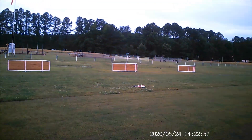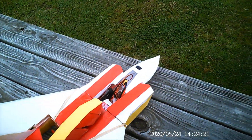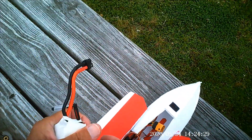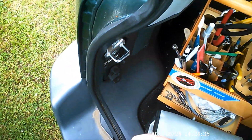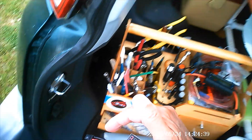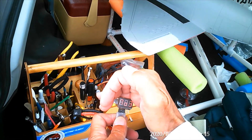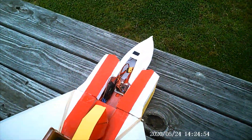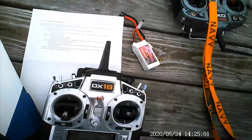Let's just see how the motor feels — not warm, really. I don't know if you can tell: 30-amp ESC, Lemon receiver, and a 1300 milliamp 3-cell 55C LiPo battery from China Hobby Line. The motor is a 2205 2300kV quad motor — it's got the reverse rotation, counter-clockwise.